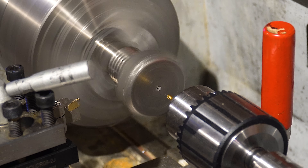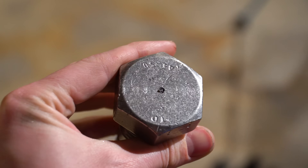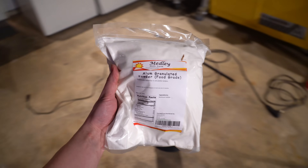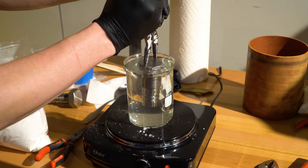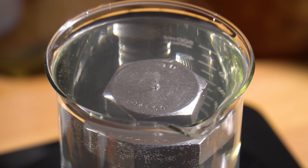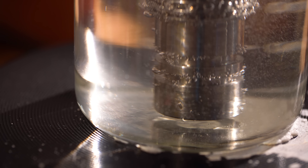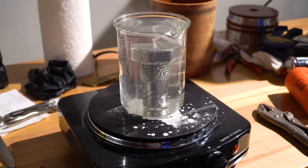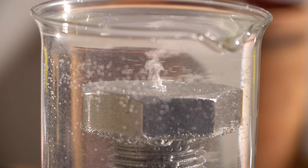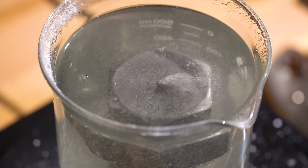That's really bad. I tried very, very hard to dissolve this drill bit out of the stainless steel part using alum powder, which when dissolved in water slowly eats away at the tool steel while leaving the stainless steel mostly untouched. This definitely worked — had I kept going, it probably would have removed the whole bit — it's just that it was very slow. Over about 30 hours of boiling in fairly concentrated alum powder solution, the bit eroded about a half inch. Either way, I don't have the patience to wait for this, so I started work on a new HEI bolt from scratch.